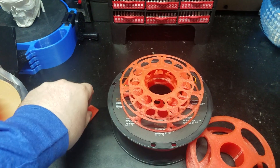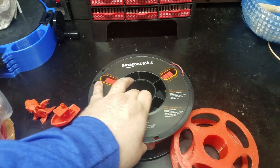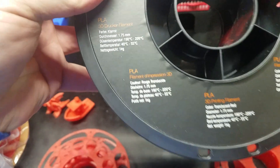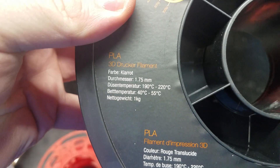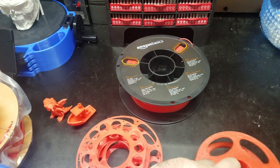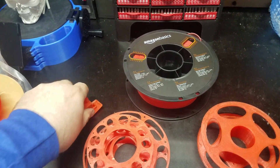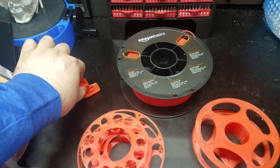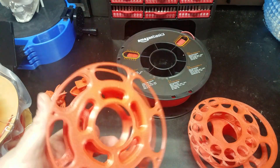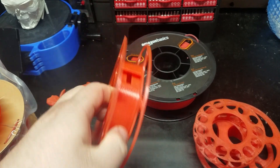But it does run absolutely great and I absolutely loved running it. It calls for 190 to 220 degrees — every bit of this was run at 200. It absolutely loves 200 degrees on both of my machines. This was run on my Anycubic Kossel, and these were run on my Wanhao i3+. First shot every time, no redos, multiple parts, smooth finish on every single one of them.